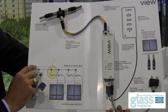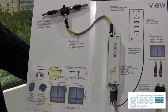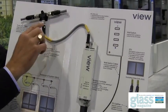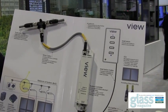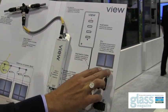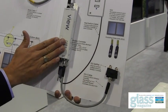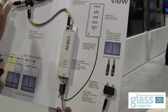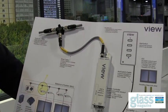This is a 24-volt line that runs in the drop ceiling in a commercial building, and then window configurations drop off of that. It minimizes the wiring, and we use dust and waterproof pre-terminated connectors so connections don't get messed up during installation, making it very easy for installers or low voltage pullers. Pigtails come out of the insulated glass unit, get pulled together into one line, and connect to a window controller made by VIEW. That controls the voltage algorithm that makes the tint occur on the glass, and then that comes into the common trunk line that runs the perimeter of the building.